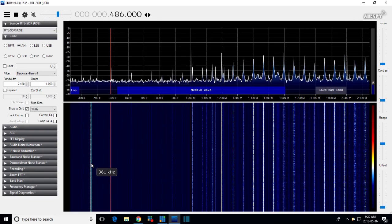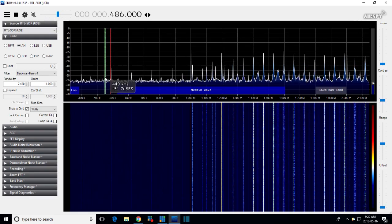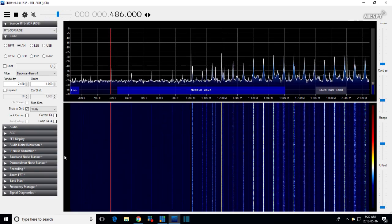So at this point in the radio, the only thing that's important to the radio is the 460 IF frequency. Everything else is kind of junk at this point on the plate side of the mixer tube. This radio, maybe it's getting rid of all that junk. We can't see it. But interestingly enough, we should see something down at 460 in here. I didn't see anything there either. Why? Okay, I'm going to turn up the output on the sweep. Way up. Okay, that's quite interesting now.